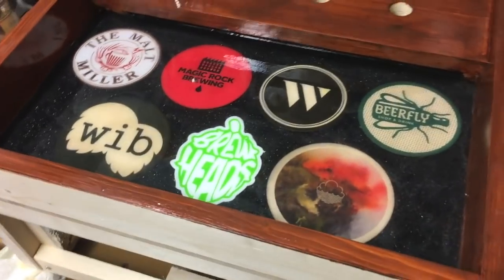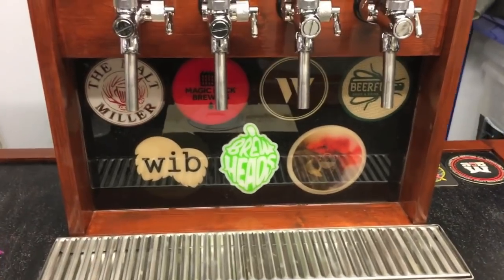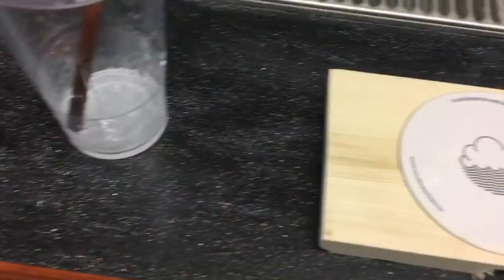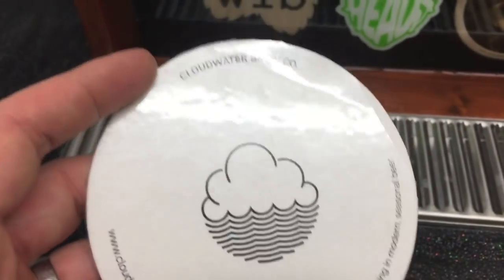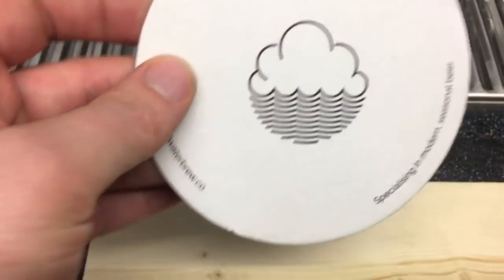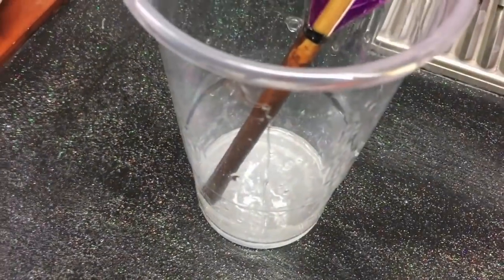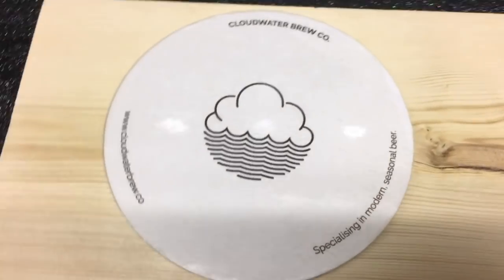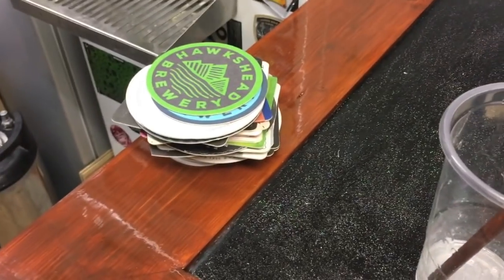The tower is now in place with all the taps fitted. The discoloration on the mats was not as I wanted it, but I can live with that. For the ones on the bar top area, I'm going to try covering them in transparent photo paper. I've already put a bit on one as a test — it didn't quite cover the whole thing. The white areas on these ones are the ones that discolored the worst, so I'm going to mix up a little test batch of epoxy and put it over the top to check that the photo paper provides a decent enough barrier to the epoxy soaking into the cardboard.